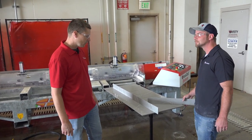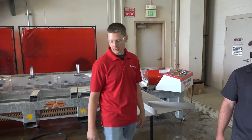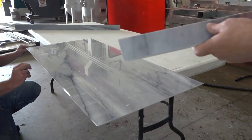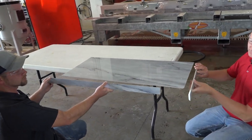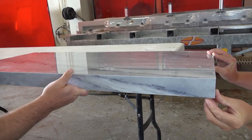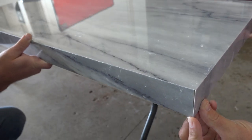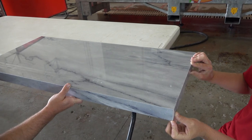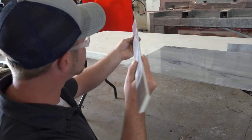We also had another piece I ran earlier with the porcelain blade — that's why the VFD is important, so I could control the RPM for that blade. This part had 2-inch drop aprons — a 12-millimeter stone, about a half inch thick. We still get nice crisp edges on these miters; fold them together — nice tight edges, ready for gluing and fabricating. That's pretty good for porcelain, especially since this material is getting more and more popular and a lot of it gets mitered because it's so thin. No chipping.